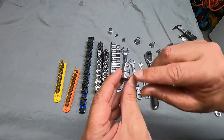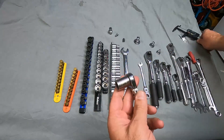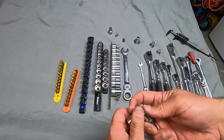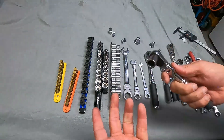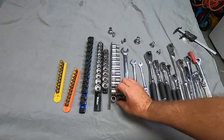Here's the 3/8" drive from LA Bear — this one is also driven by a 13mm. Right about 1.47, so maybe this one is even a little shallower than the GearWrench. But we throw that regular ratchet on there and we're at 1.56, so it could be beneficial in a really tight access situation, but not a huge difference.